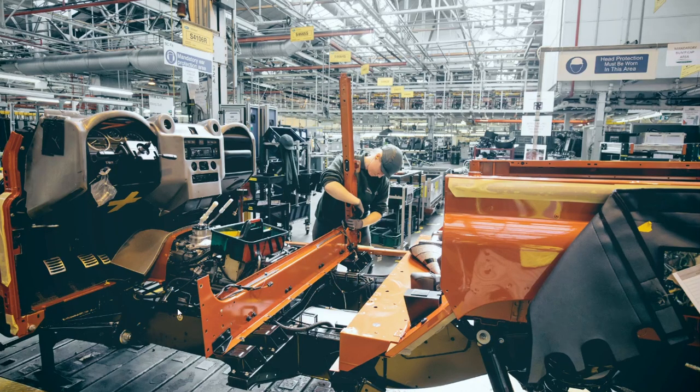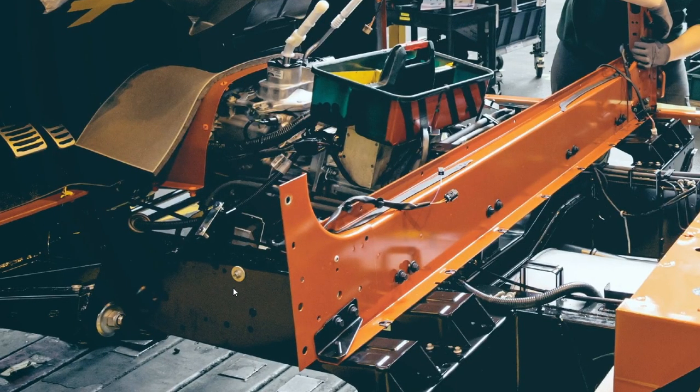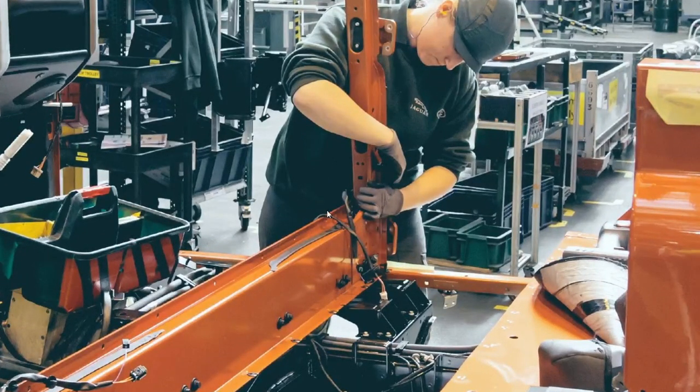This is the reason why they don't fit the seat box. This is the problem I had, because when you're fitting it, the B post gets clamped either side by the tow panel on this side and the seat box on this side. You need the seat box removed so they can move the B post back to slot the C post up in here, and then bring the sill up to the A post here.